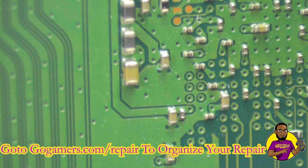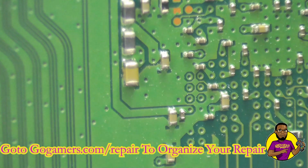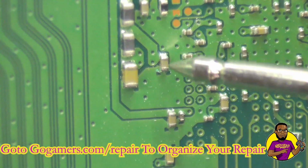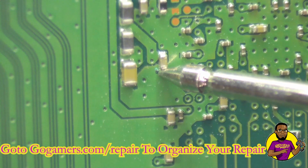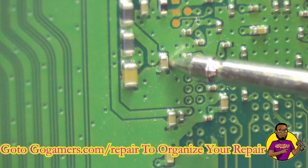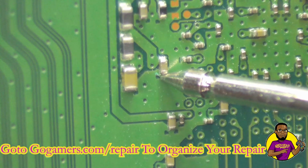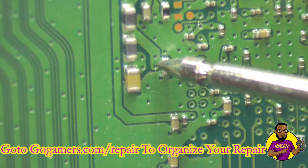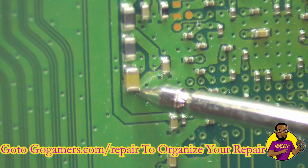So I'm going to put my black probe on ground, meaning I'm just going to put it on one of these screw holes. Then I'm going to put my red probe to the side. Okay. I have a beep on both sides. One of them is supposed to be ground, the other one is not supposed to be ground. This one is completely shorted out, and typically when this one is shorted out, usually these are shorted out too.